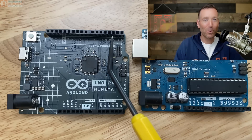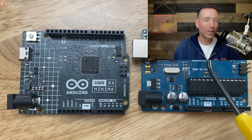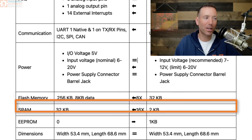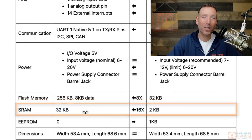The Arduino Uno R3 had two hardware interrupt pins. As far as I can tell from the documents I've seen so far, there may be as many as 14 external interrupt pins on the Arduino Uno R4, which would be pretty cool. The R4 also has a CAN bus. The flash memory on the R4 has gone up by 8x to 256 kilobytes, and the SRAM has increased 16x to 32 kilobytes.